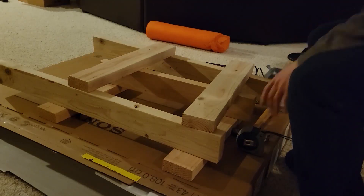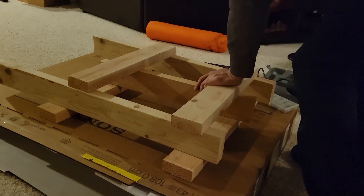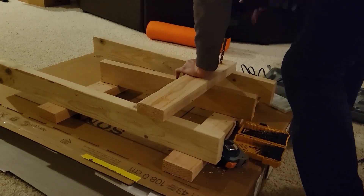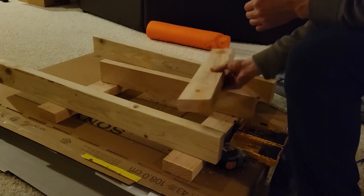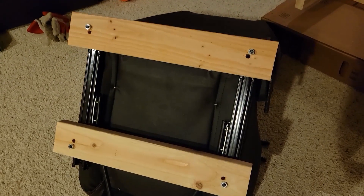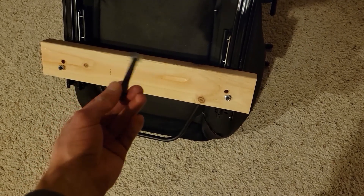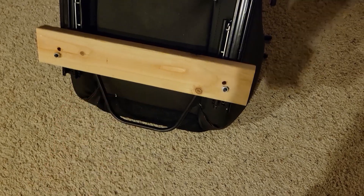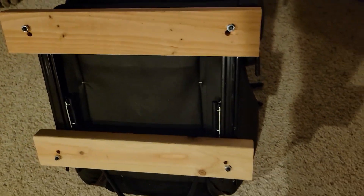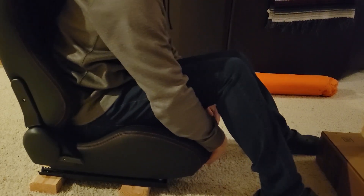Now to get into the construction side of this project. The first thing I'll do is drill some holes to mount the seat to these wood planks. I used a standard power drill, making sure to drill pilot holes first to avoid splintering the wood as much as possible. It's important to measure twice and cut once — the quality of this rig can be significantly better or worse based on measurements alone. I went ahead and mounted the wood planks to the base of the seat, and they fit perfectly. I used 2-inch 5/16-24 bolts and nuts to fasten the seat to the planks, and they make a nice sturdy connection.